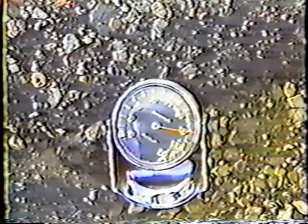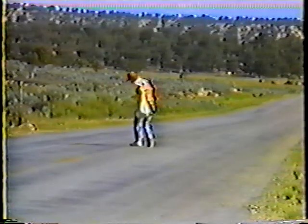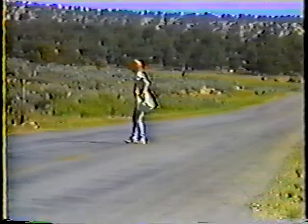When the forecast is good, the pavement temperature is above 70 degrees, the air temperature in the shade is above 70 degrees, the cover material is damp, and all traffic control devices are in place — now you're ready to seal coat.